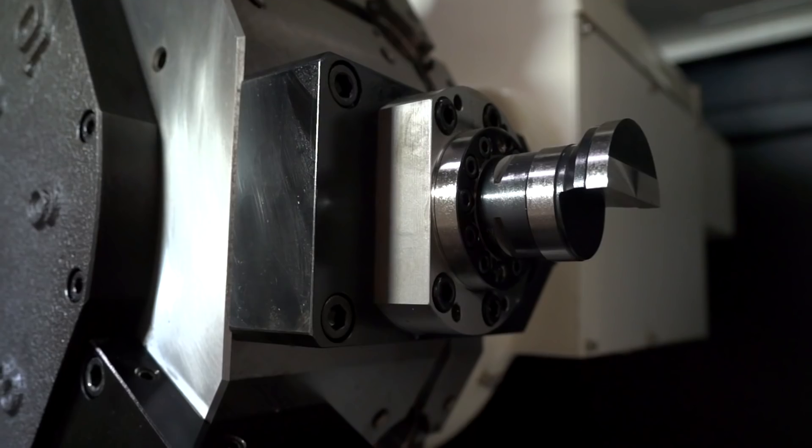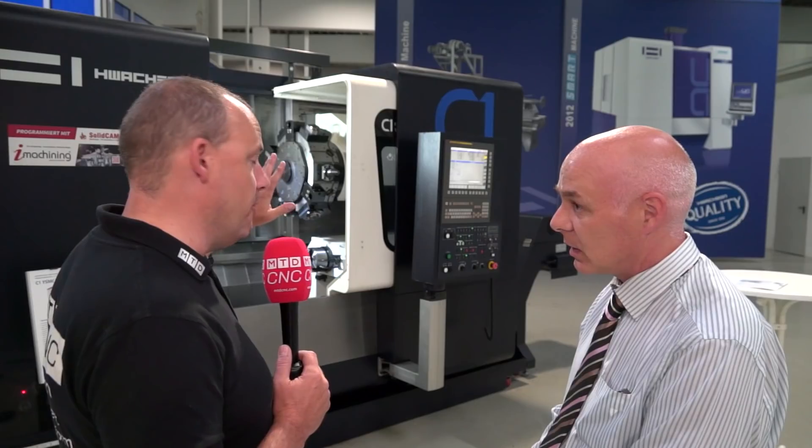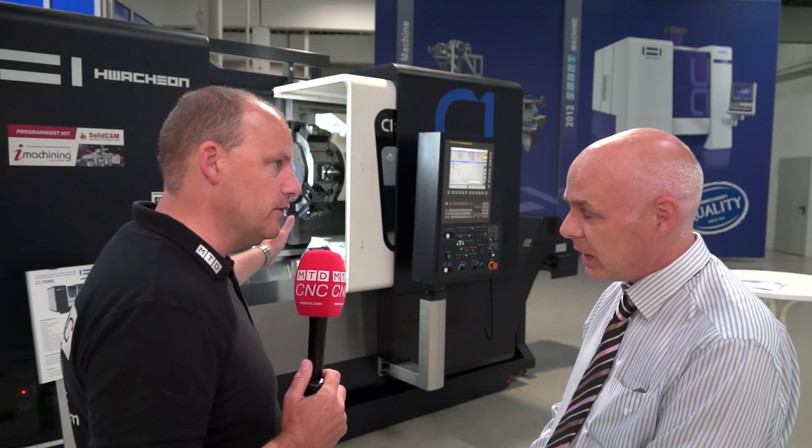What's the format of the tool — what size of tool? They are a Capto C4 tool. So you've got 18 tools on the turret, or the potential of 18 different positions, and then you've got another 12 here — so essentially you've got 30 tools.